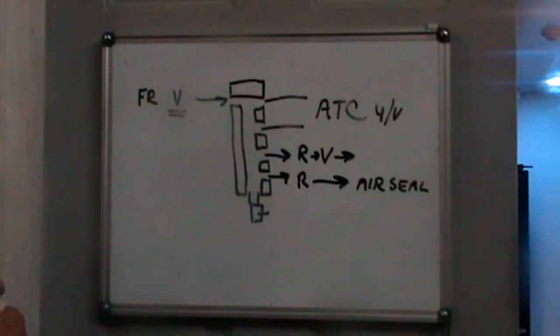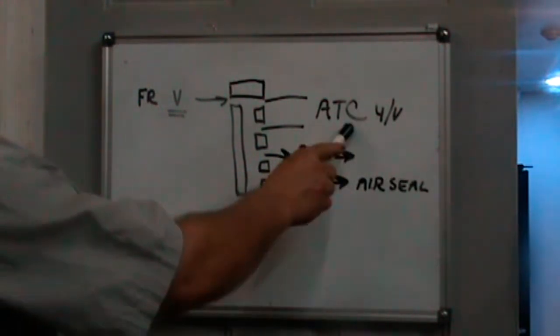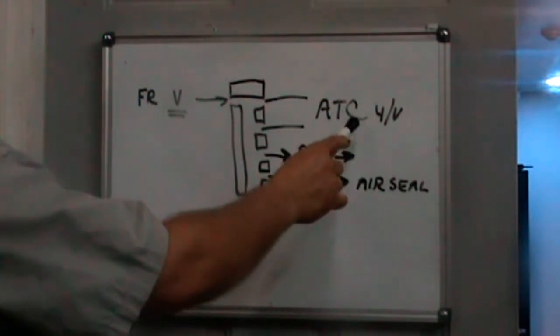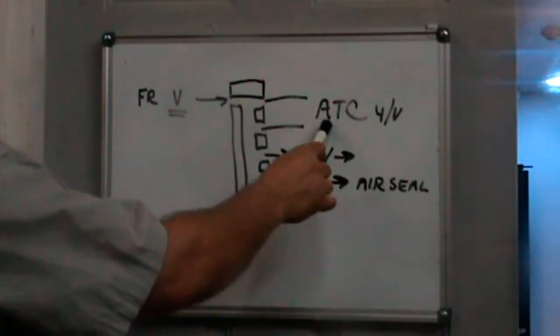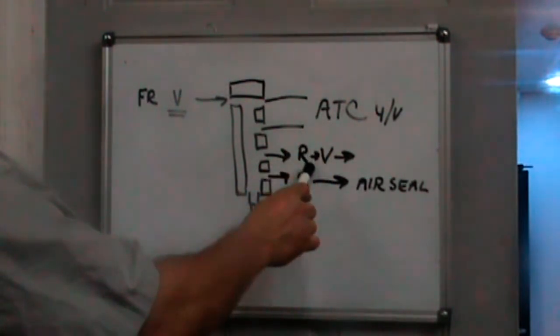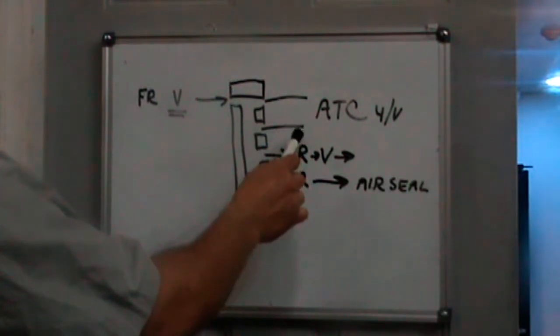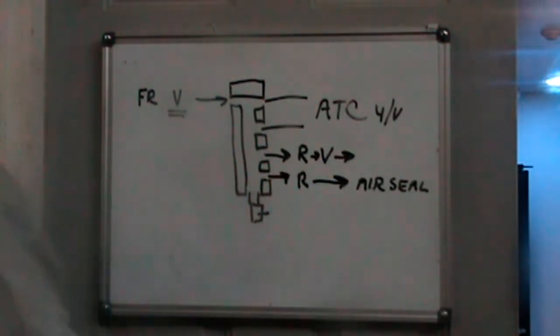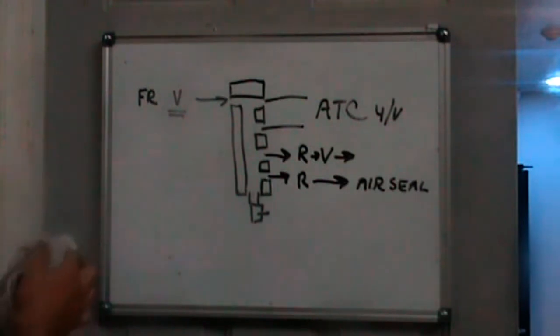Well, that went out the window. The electric solenoid valve I wanted to use here doesn't seem to work, so I'm going to use a manual four-way valve here. If I use a manual four-way valve here, I don't want to use an electric valve here, because then I would have to actuate the manual valve manually and press the button that actuates this at the same time, and I wouldn't have a third hand free to actually change the tool. So we're going to change all of that.